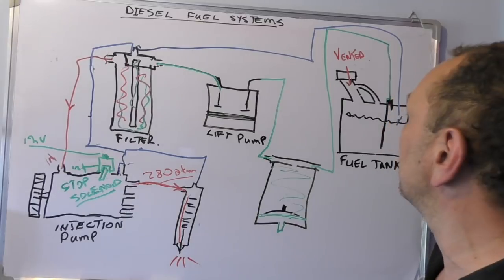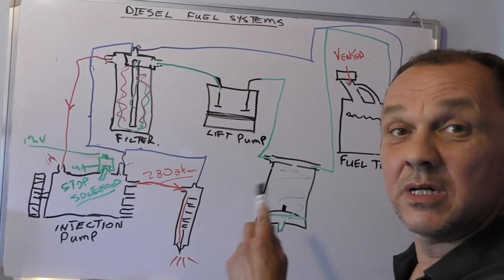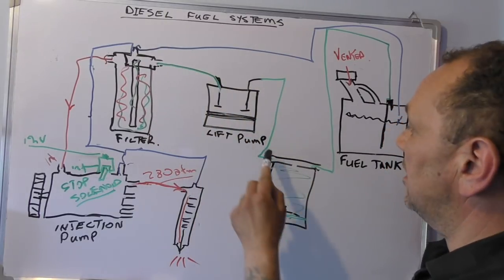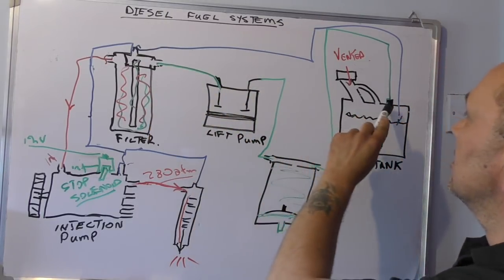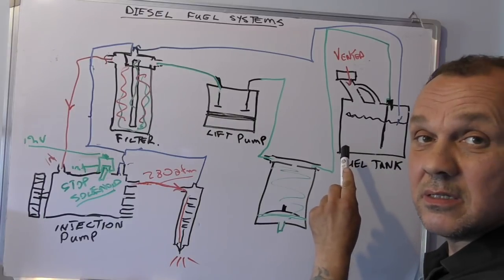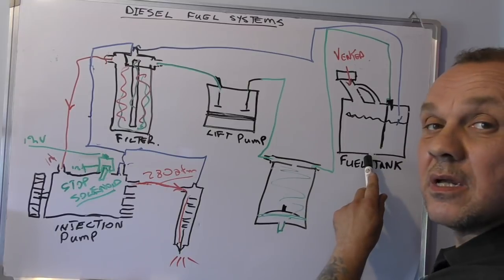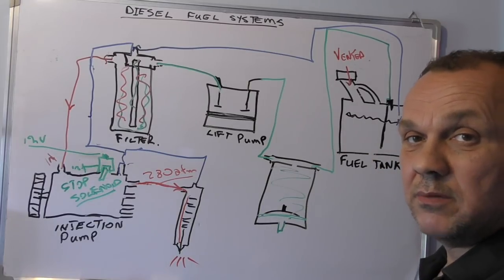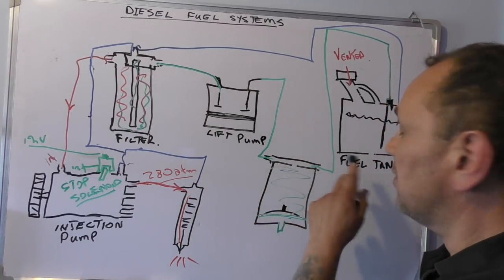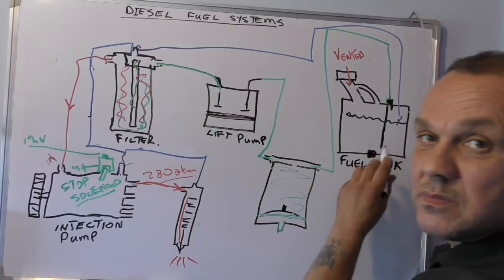If the stack pipe is blocked, it'll be the same thing. Key points: your piping probably isn't gunched up — it's more likely at a union fitting anywhere in the system. If it's gunched up in the stack pipe you've got really big problems because there'll be loads of debris in your tank. You do have a drain in the bottom of your tank which you can undo, drain it all out, see if there's any crap in there, and put clean fuel back in if needed.